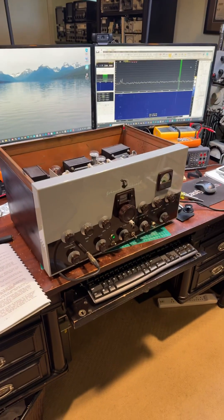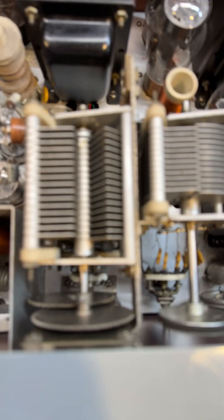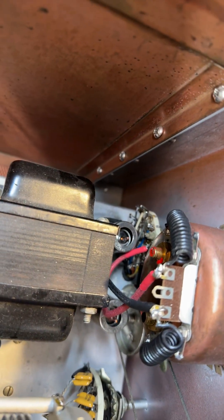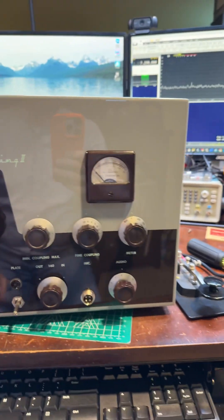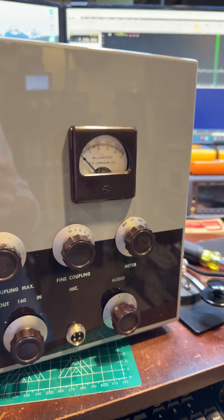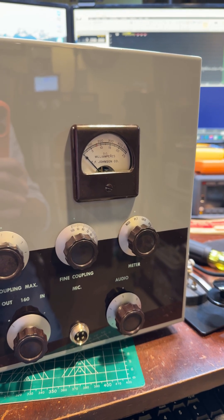So, I cleaned the shaft of the roller inductor, which is hiding right down in there, and then while I was there and tinkering around, I discovered that that selector switch you see way down at the bottom was a bit intermittent, giving me erratic and unreliable readings on this meter using the meter switch you see there in the lower right corner of the meter.